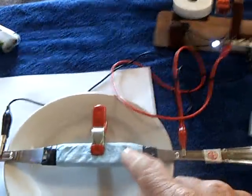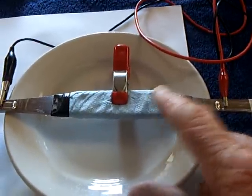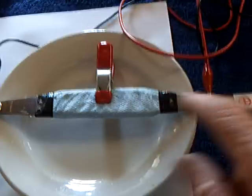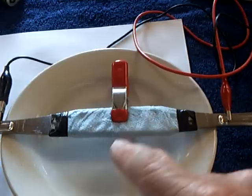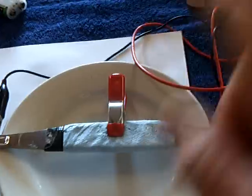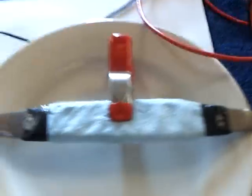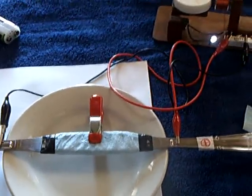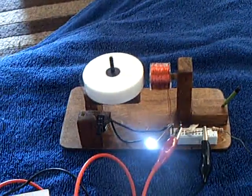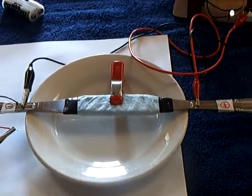I just wanted to show folks what I'm doing here. I don't think this is anything more than perhaps a very unusual galvanic battery. Because when I take this apart, I see the rust color on the positive plate, which indicates to me that perhaps I've got the ion exchange going between the metals and not the back and forth with the SO4. But it's very interesting, and the fact that it's rechargeable — at least perhaps during its short lifetime — I thought was very interesting. So I thought I would share that. This was the all-stainless-steel homemade rechargeable battery. Thanks for watching.